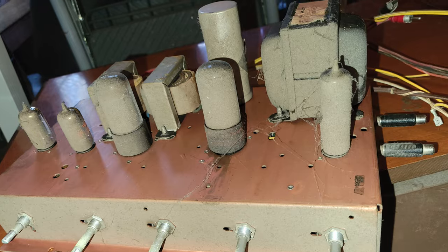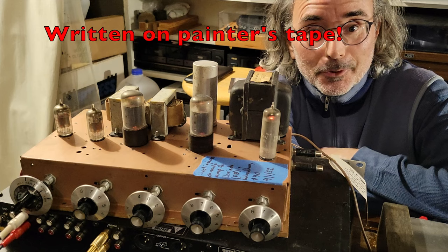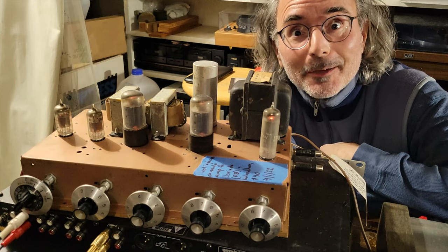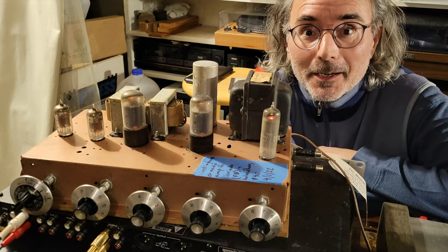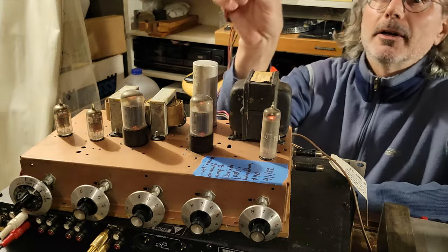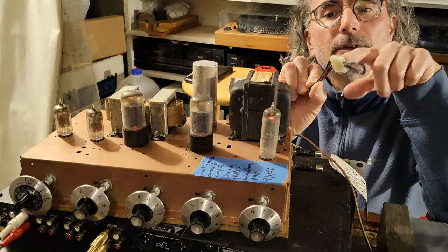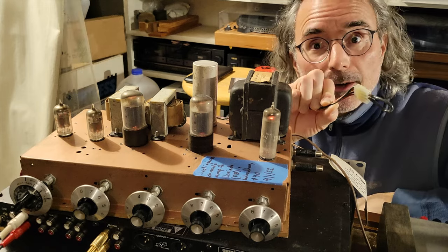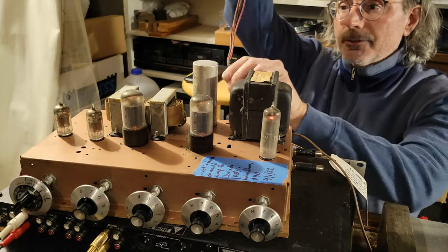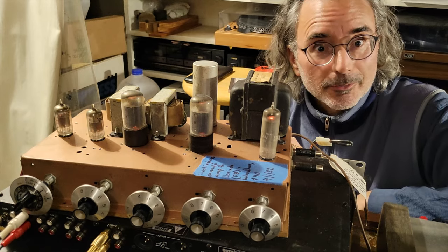I brought it back, took out the amplifier, and I've tried to get this console amp to work. I am currently playing music into it and not getting any out. It is powered up — the tubes are hot. The way I've done it is to bridge two of the connections on this Molex plug here, and that's typically how the switching is done on these things. Some wires come out of the back and go to a Molex plug which plugs into somewhere where there's a switch.